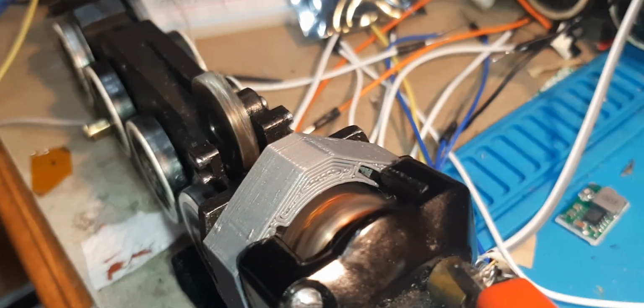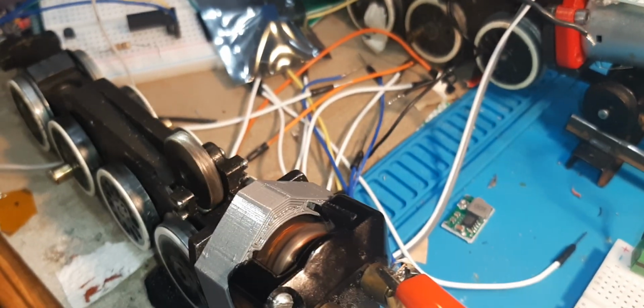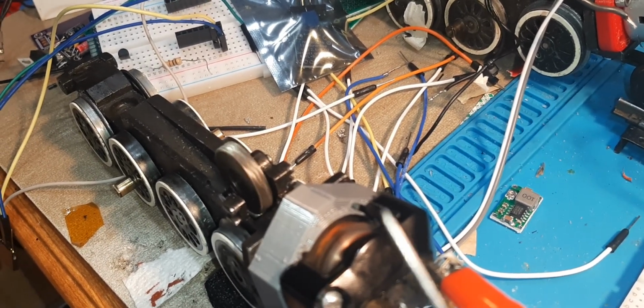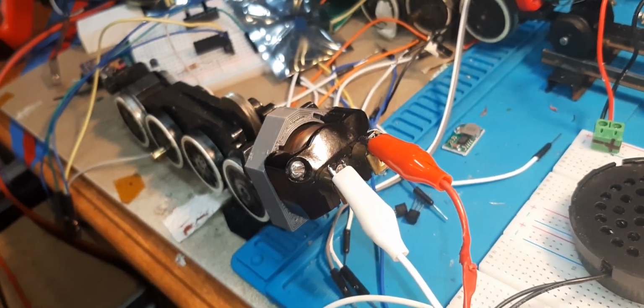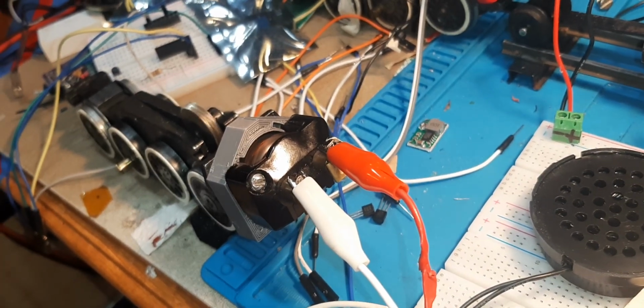You might be able to see a little notch, a little gray, little silver notch. See if I can use my pointer here. Right there, a little notch there, and there's another one over there. Inside that sliver of a notch, it's an arc shape. I've put in arc-shaped magnets on both sides, and then I assemble this motor with the springs and the brushes